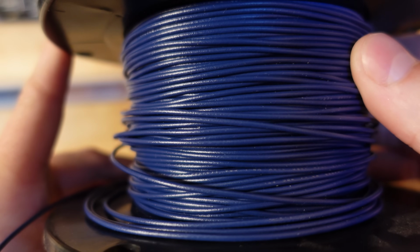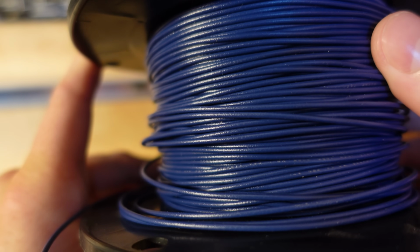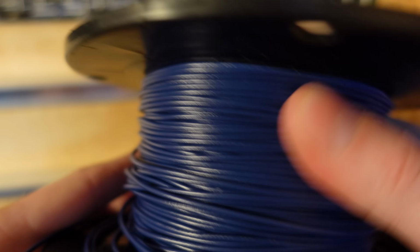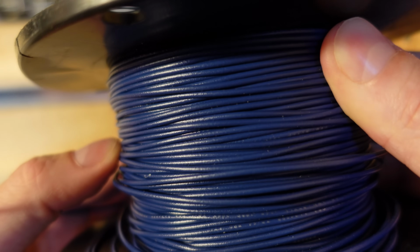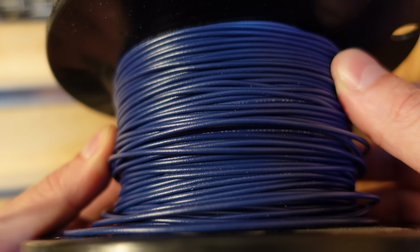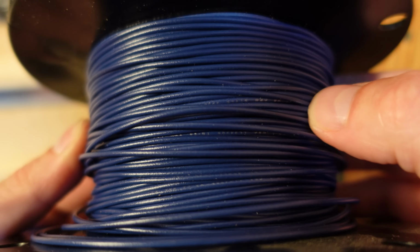So I'll be using the same 20 gauge MTW rated wiring for installation. This is the same wire I used for my Watchmon 5 and my MM8. I really like this wire. The insulation is very tough. It's difficult to damage, so it's good for an installation like this. It's very important to pick quality wiring. Some of the wiring that's out there that's cheap is very soft insulation, like your fingernail can actually cut through it and whatnot, and I just don't like that stuff at all.